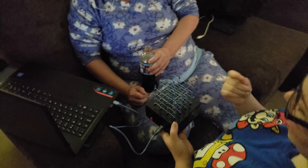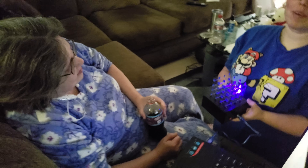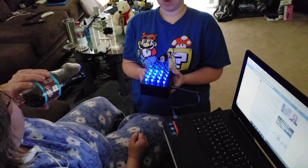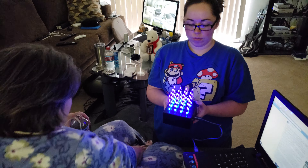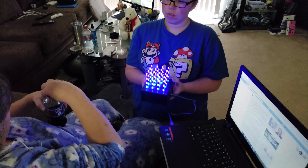Some people's one of their columns doesn't light up all the way. I kind of want to unscrew it and show you the wiring inside — you have resistors and all that in there. Maybe their resistors aren't right, that's why theirs don't light up. Everyone's resistors are the same — 200 ohm resistors. If you don't solder it right, that's the problem.